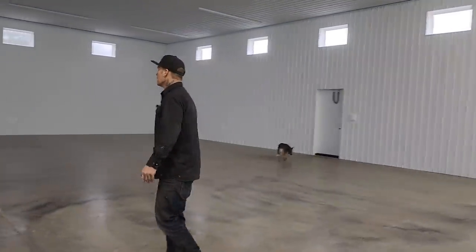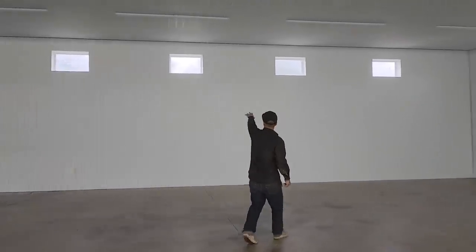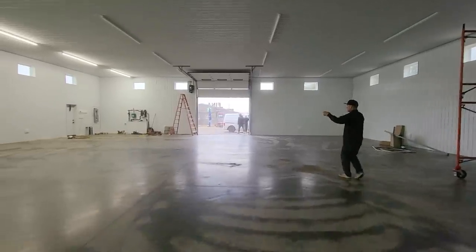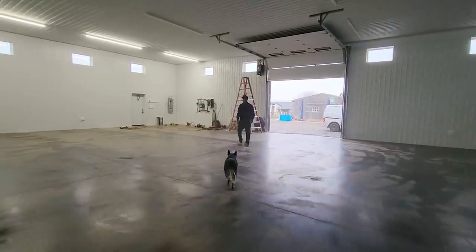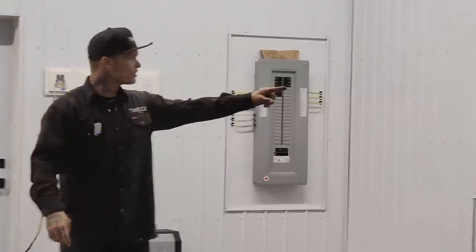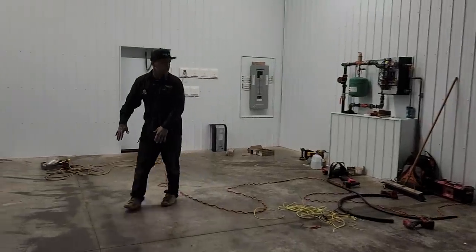It's nice — it's clean. I like that they put a nice finished piece along the top of the metal instead of just stopping. All the windows are cased in plastic — they did a nice job. All the lights are straight. When you go over to the panel board, you can tell all the wires come out of the wall nice and straight — that's something someone should notice when getting work done. The heat system — I think they've already charged that full of glycol. So the floor is all in-floor heat — it'll probably take three or four days to get it heated up.